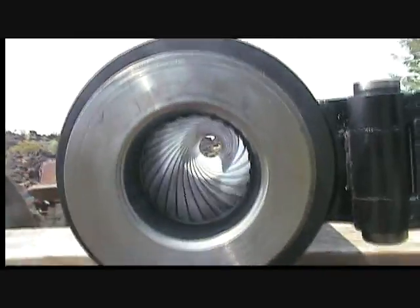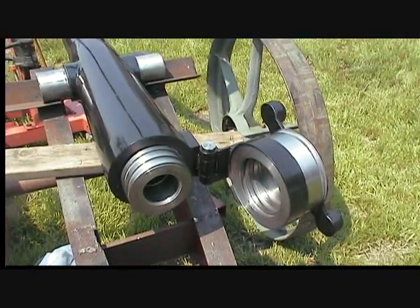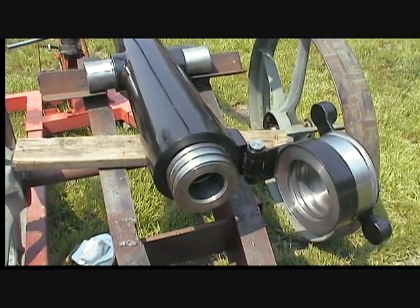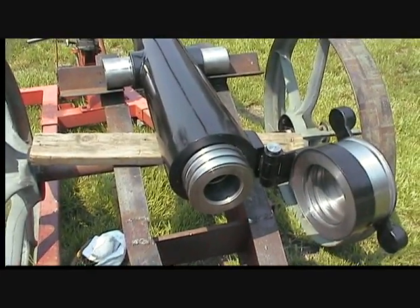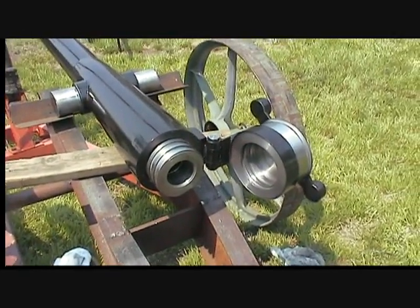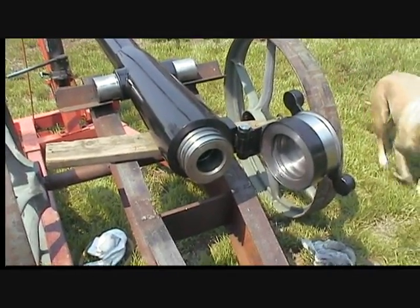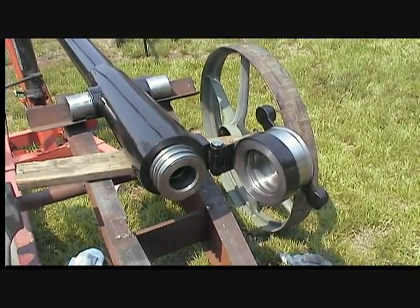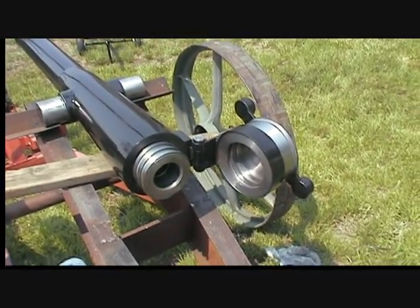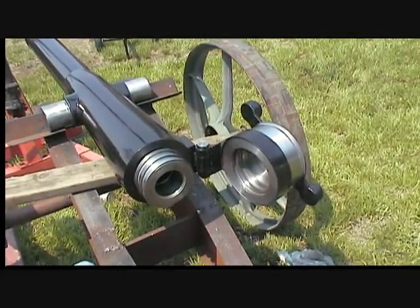And that's just been cleaned with water — I haven't got any oil in it yet. The cap works so smooth it's unbelievable. There's about 30 thousandths clearance on the cap to the threads. The threads are one thread per inch, half inch wide, three-eighths deep. Like I say, there's about 30 thousandths clearance total — not each side, total. It makes the cap just pick up the threads so easy, just boom, right on. After you fire the gun, you don't even need the hammer handle — it's got one like the other Whitworths, but you could just grab the cap and thread it off by hand. It's just so smooth.